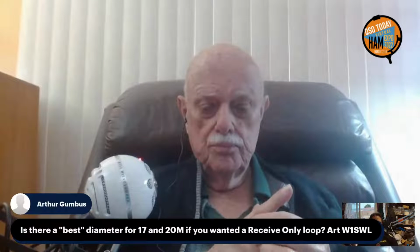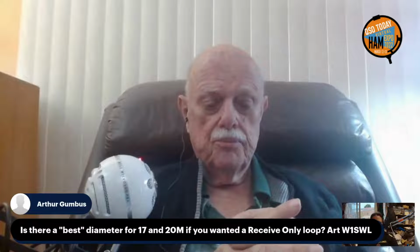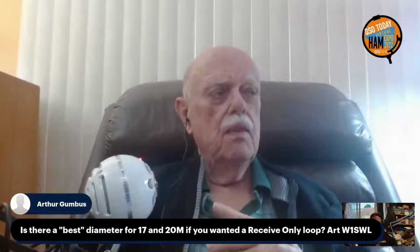Arthur, W1SWL, asks, is there a best diameter for 17 and 20 meters if I wanted to use it as a receive-only loop? The 4 foot square loop is a really good compromise for middle HF. I find 3 to 5 feet is a good size for the middle of the HF band. 3 foot doesn't go down much below 20 meters. I would say if you want to hit 17, yeah, a 3 foot loop will go down nicely to 17. So a 3 or 4 foot loop is roughly a pretty decent sized loop. Right, and then you can use 2 inch diameter conductors though. Perfect.